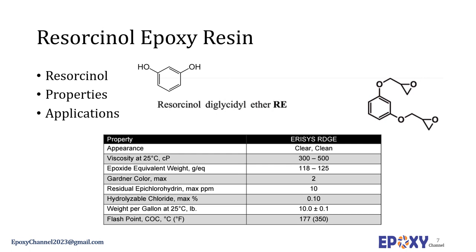Resorcinol is a phenolic compound — an organic compound that is one of the three isomeric benzenediols, the 1,3-isomer or meta-isomer. Resorcinol crystallizes from benzene as colorless needles, readily soluble in water, alcohol, and ether, but insoluble in chloroform and carbon disulfide. Resorcinol is mainly used in the production of resins; as a mixture with phenols it condenses with formaldehyde to afford adhesives. Such resins are used as adhesives in the rubber industry and for wood glue. Resorcinol-based adhesives are both strong and waterproof, making them effective for use in boats or humid environments.